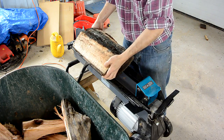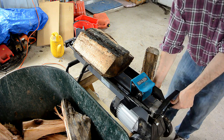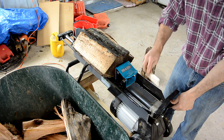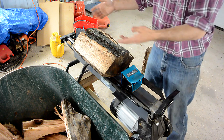If you're splitting shorter pieces like this, it's annoying always having to wait for that cylinder to come forward. But this is why I made this thing in here — I put that there, and then the cylinder can't go all the way back, so I don't have to wait as long.